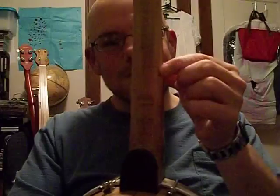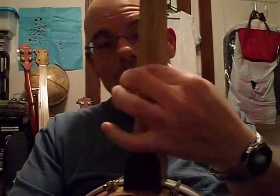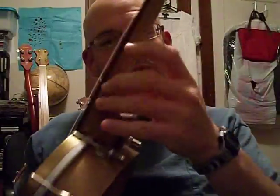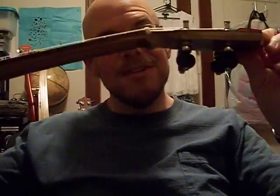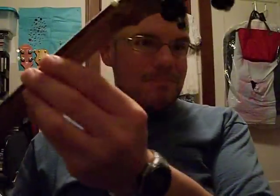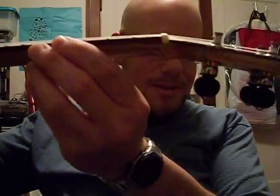Seemed to work real good. I made several necks like this and they've all been real stable, no problems at all. You probably can't see them, but if you look at it in person, you can see the 3 pieces of maple where it's been laminated like that. Plus side too, you can rip your boards to the proper width and you can get your headstock angle into that too. Carved a little thumb stop into the neck there too. You can probably see that pretty good on the camera, I imagine, but I think that turned out really cool looking.